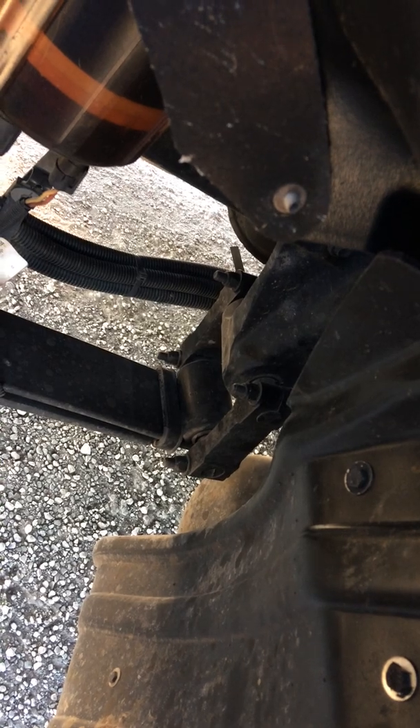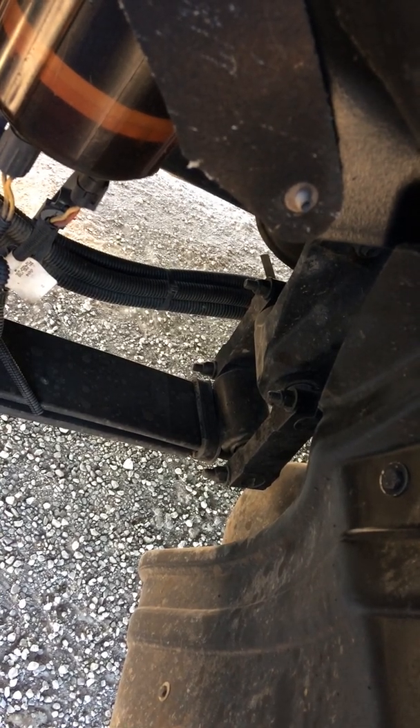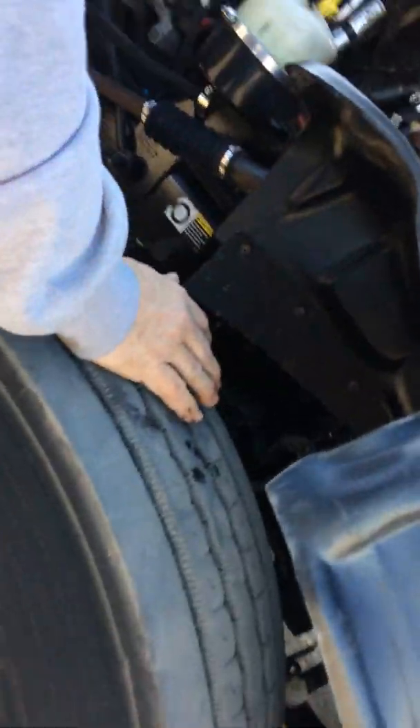Now I'm going to talk about my service line. It supplies air to my brake chamber. My brake chamber is not worn, torn, or frayed. It's secure with the fittings and they do not leak. The clamp is secure and tight around it — not bent, broken, no holes, and it does not leak. My push rod, when released, has no more than one inch of travel. It's not bent or broken. My slack adjuster is properly greased, the pins are in place, and it's not broken. Going inside: my brake lining is not worn dangerously thin, no contaminants, and no less than a quarter inch. My drum is not cracked or broken, no holes, and no contaminants.